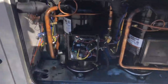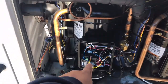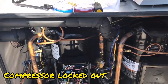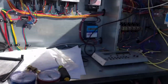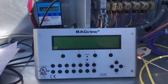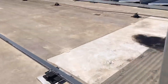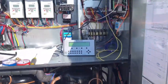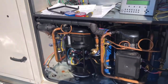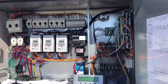Just giving it a quick visual. My core sense module was normal, so that's not the problem for us tripping. All of my breakers are good to go. Nothing has tripped. I did have an alarm in here — I just reset the system. One of them was a high pressure alarm, the second one was compressor lockout. Before I do anything, I just kind of let it run through its cycle, let it go through its time delay, and we'll figure out what she's doing.